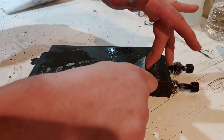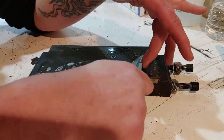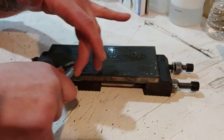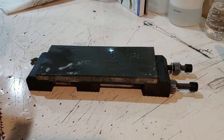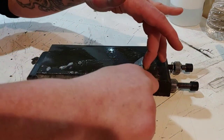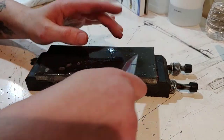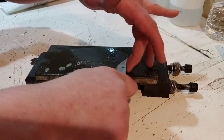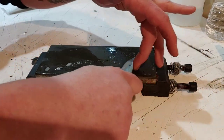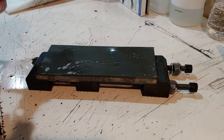I didn't mean that if I go back and forth like this it will convex the edge. I just mean that I'm going to have more likely of a chance of producing a nice flat edge in this circumstance. I probably could get a flat edge just by going back and forth without a problem, but right now I'm choosing to do single strokes — nice and controlled. I can watch it hit the tip, watch myself hit that part of the stone on that part of the tip and go back. Every little tiny bit counts. I'm trying to do the exact same motion every time.